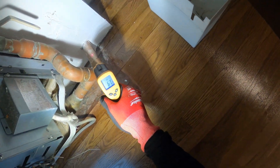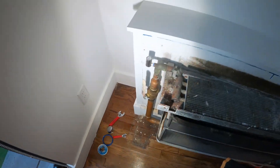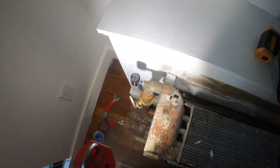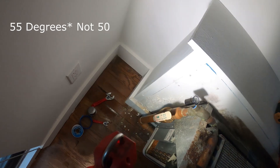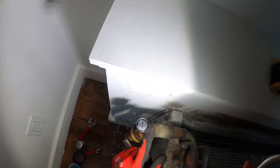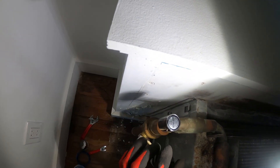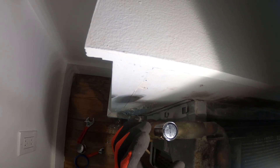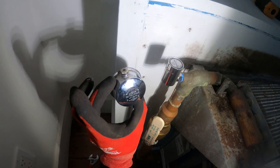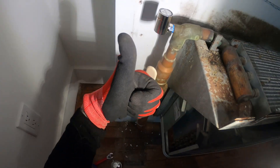The pipe coming in is at 67–68 degrees, which is room temperature. It's November 30th and outside it's 57 degrees, so this building's system doesn't turn on the heat until it's 50 degrees or lower outside — it's on ambient control. We're not going to see live steam today, but this is how you install your air vent valve. Start with it closed and slowly adjust it so you don't get any water coming out. If you found this video interesting or helpful, please drop a like, comment, and subscribe — I'll catch you all next time.